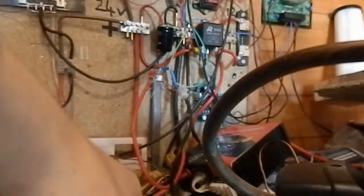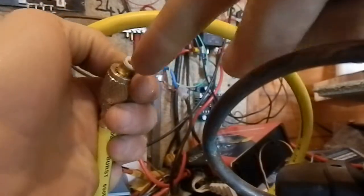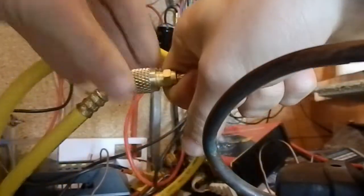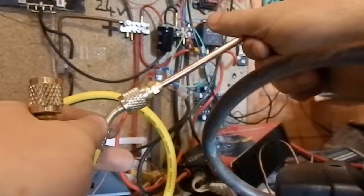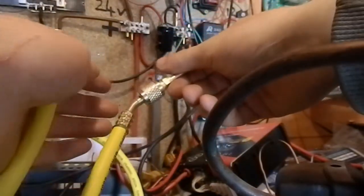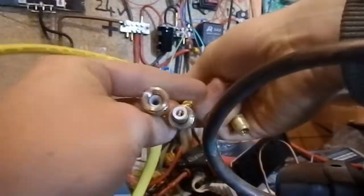I'll put links in the description to exactly what I ordered. This is the hose here. On the end it's got a piercing bit, and a bit in the middle that connects to the service valve. That fits on there and just screws in quite tightly. This other end would go into your refrigerant charging bottle. What you're meant to do is put this into the middle of a gauge set and have gauges hooked up to the system so you know the high side and low side pressure. But I don't really need to go to that length — I reckon I could charge it just by sight and feel, hopefully. That's a standard charging hose.